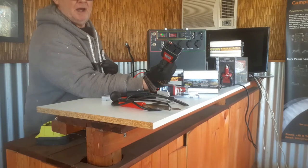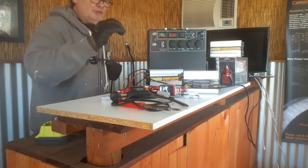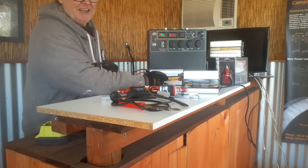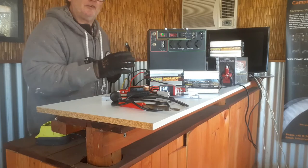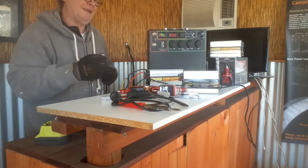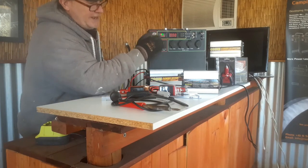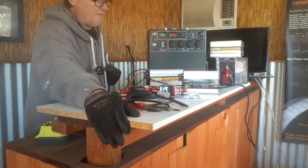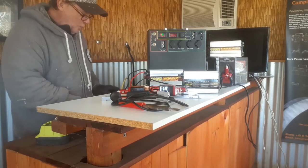You probably only want to run inverters at 70 percent capacity at most. With a 300-watt or 600-watt inverter, do not take the upper burst range of 1200 as a running figure — it's absolutely not. You'll end up frying the inverter. The biggest problem is people think they can plug anything into it. The Nomad PDU has a maximum 20-amp output — that's one of the key things to remember.